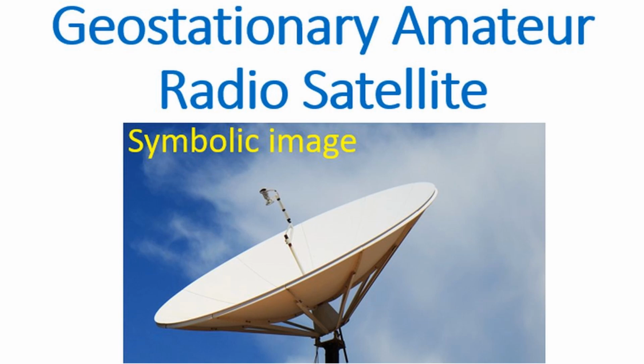There are many in my region also who work through the transponder on the Qatar Oscar 100 geostationary amateur radio satellite located at an altitude of 36,000 km. But that needs much more setup with signals being sent up on 2.4 GHz and received on 10 GHz using a satellite dish antenna. The radio needed for that is much more expensive than the VHF radio which I am using. Setting up the antenna and feed lines for QO100 is much more difficult than setting up a LEO satellite radio and antenna, and I have not ventured into it yet.